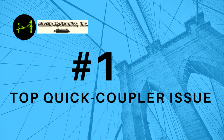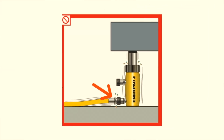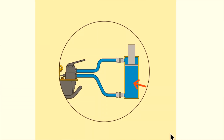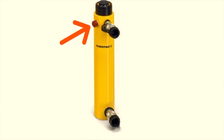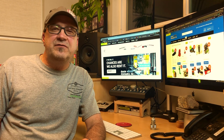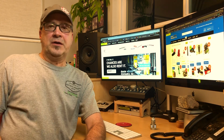As mentioned in Number 3 about blocked couplers — if the return side flow becomes blocked at the coupler in a double-acting cylinder setup, as the advanced side is allowed to continue to build pressure, the cylinder will likely burst or blow the coupler out, threads and all. This is due to the advanced side of the cylinder having a larger effective area than the return side, because the rod takes up volume on the top side of the cylinder. Well-designed cylinders have a safety relief valve built into the return side, though not 100% guaranteed. Avoiding a blocked coupler will likely save you the downtime and repair cost of sending the cylinder in to have that valve seat reset or replaced.